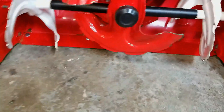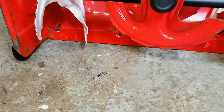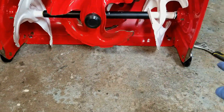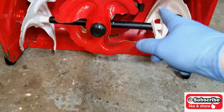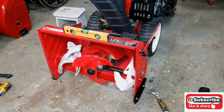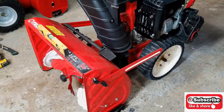The shoes are all tight now on both sides, and you can hopefully see there's a bit of a gap underneath that shave plate. That's such a small gap it's not going to leave a lot of residual snow behind when you're blowing. Now if you have a gravel driveway, you're going to want to adjust those shoes down even further to leave a little bit more of a gap — maybe a quarter to three-eighths of an inch — so that you don't pick up a lot of stones and start chucking them through your chute and out into your lawn. Hopefully this video is helpful. If you like the content, please smash the like button, share it with your friends, and if you're not a subscriber, consider doing so — that really helps me on the channel. Until our next project, take care.